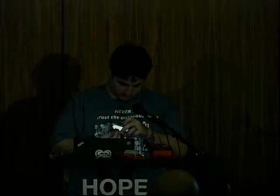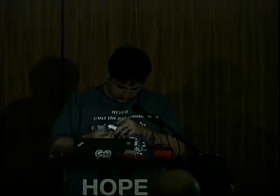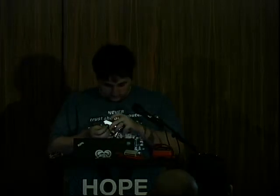0.8 pitch or whatever is awful. And no one should be allowed to make it. It's just slightly smaller than one. Okay, so this is in, and I'll be able to show y'all in a second. Without this USB cable plugged into my laptop, the board would lose power and pop out. Yeah, like I said, 0.8 does not hold anything in. When the lock is actually put together, it has plastic to hold this board down better, but it's awful.